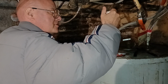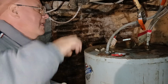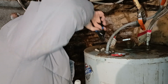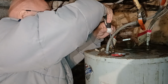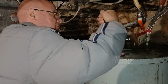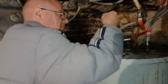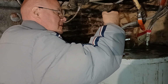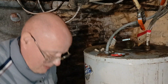I have to tighten those connectors. Turn what off? I didn't turn anything off. I turned the water off. I didn't turn anything else off. Oh, okay. Why, did you turn it off at the breaker? Yes, because as soon as he turns it back on, it'll be hot. You've got to make sure it's filled up so you don't blow out the heating element. So you're saying you blew up the heating element? No, I turned it off while you're draining it, because you'll burn out the heating element. If I turned it off and you turned it off, how did we both turn it off? All right.